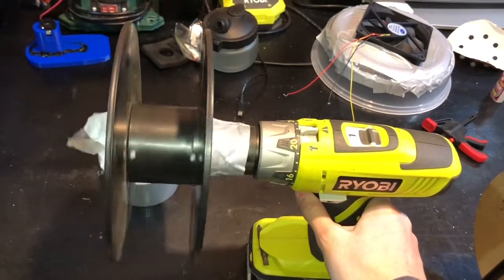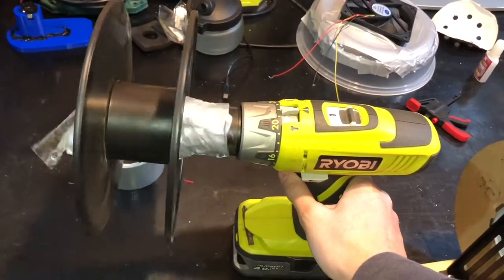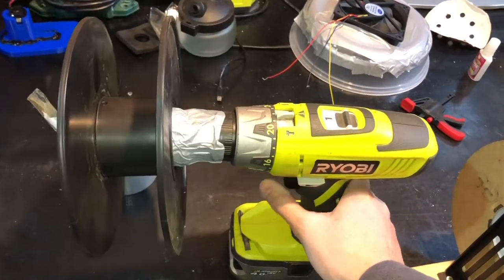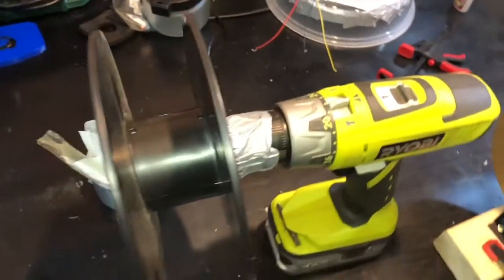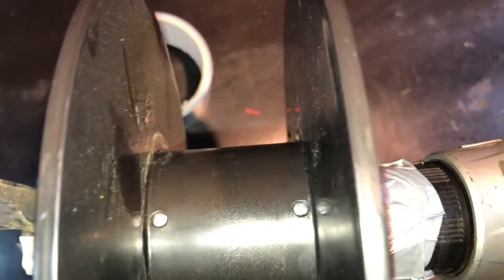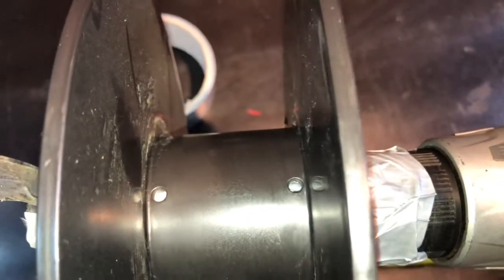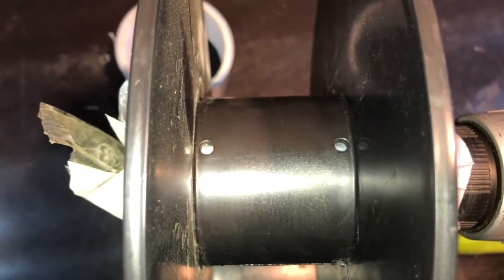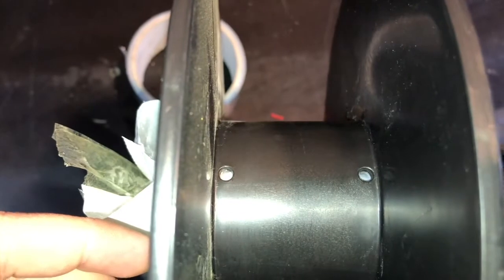Again, try very slow. If you use a proper adapter you can get things a lot more centered and probably won't have this wobble, but I'll give it a go and see how it works. Now you need to find, depending on the spool holder you're using, what type of initial securement you have for the filament. In this case, you can see there are a couple of holes that I'm going to stick the filament into, just to start binding it into the core of the spool before we start spinning and transferring.